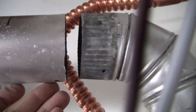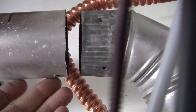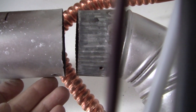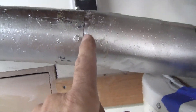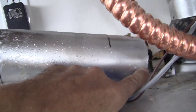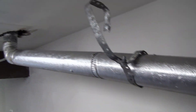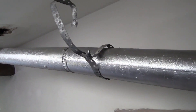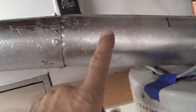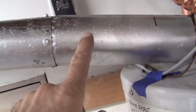Here's the issue: you have a gap. This pipe is short by approximately an inch and a half to two inches. So this section needs to be taken out, another one put in and cut to length, and then we'll be good to go. I've got to run to Home Depot to grab some single wall three-inch pipe and correct that now.